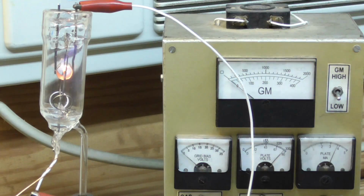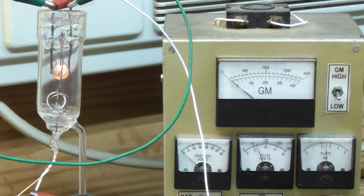See, once this is done, then we'll be outgassed altogether. That's 40 milliamps. Woo! That's some current. It's a big cathode, though. Okay, that's going to be a lot of watts. Let's see, 3, 5, that's about 15 watts. I'm going to go ahead and cut that down because we're going to overheat the tube and crack it. All right, I'm going to let it cook at that current for about 30 minutes to go ahead and form that cathode good.